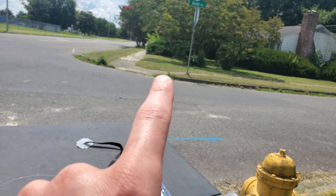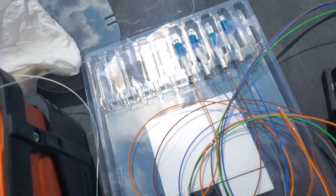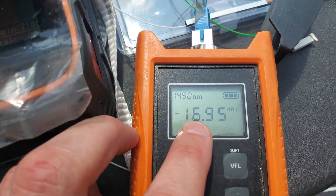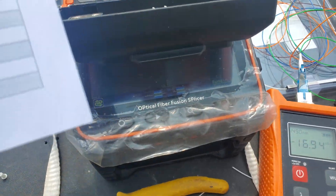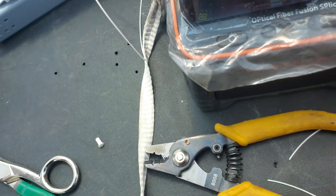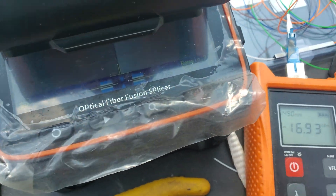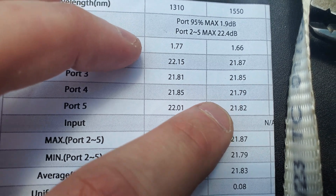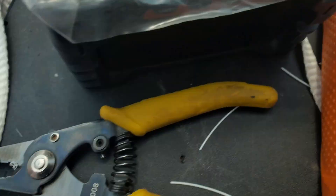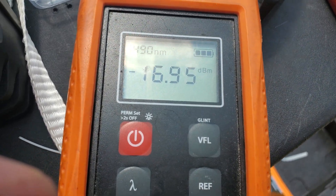Second box — we had a 95 on that block. Now we're down on the next block getting a negative 16 coming off the 95 tap. On this particular block I'm at 16.9; I was at 15.9 up there. Looking at our power sheet, that's 1.66 loss — really good, better than the spec sheet. Looks like all my taps are going to be at 16.9. Looks like I may have picked the best port — that's port four... actually right now it's port three. Whatever — 16.9, I know what I'm at.